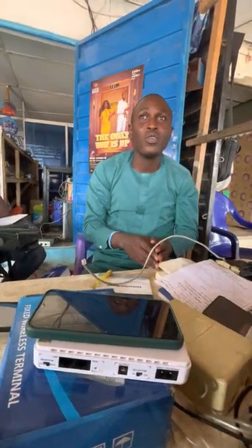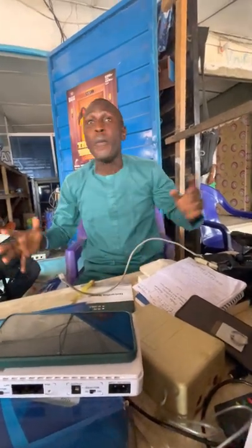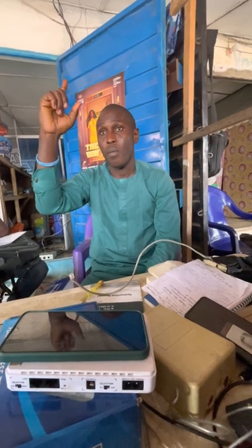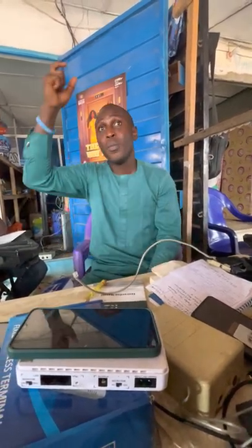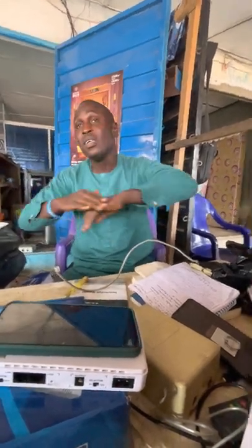What I just explained now is what we call multiplexing and demultiplexing of signals. When you bring multiple lines to a single bunch of cables, we call it multiplexing. At the other end, when you are separating it from a single cable, maybe 20 pairs, maybe 50 pairs, to individual lines, it's called demultiplexing.